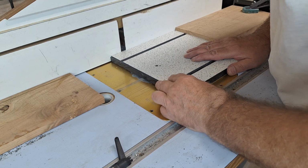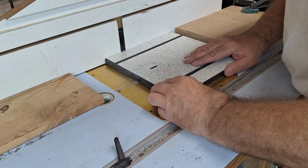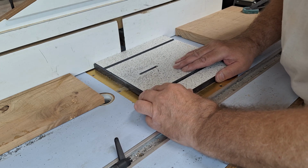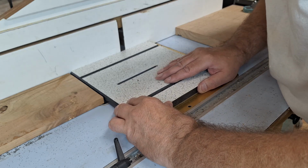Before we can glue the top carriage together, there is another slot to route. The long slot allows the top carriage to travel from one side of the blade to the other. I've made this slot longer than the original, which turned out to be a mistake, as the Bristol lever fouls the front guard. Hey ho.